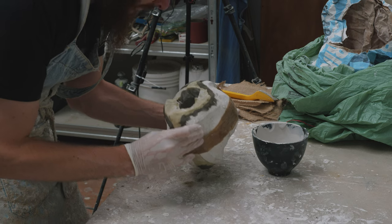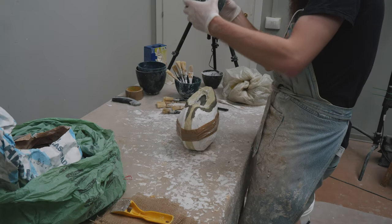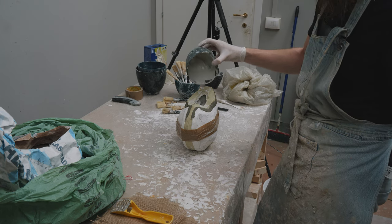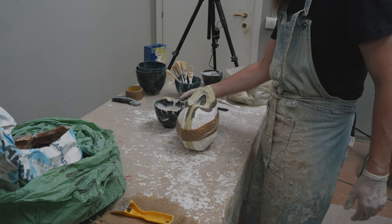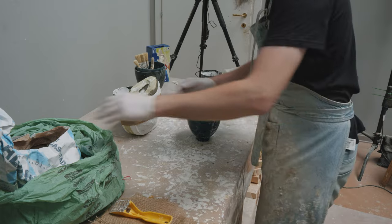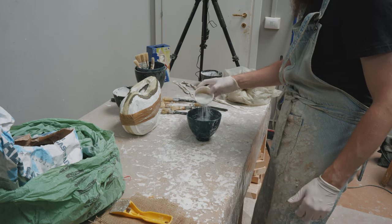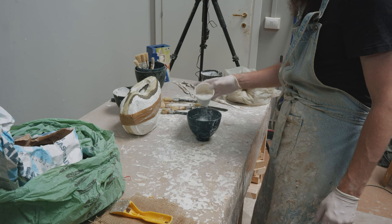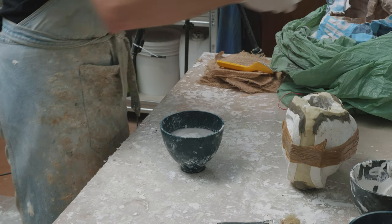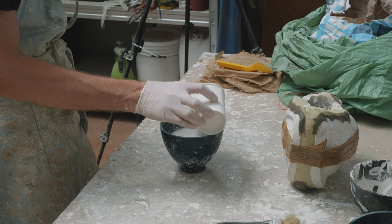Then it's going to become hard and cold, then warm before starting to cool down. It can take a while after it cools off before it becomes properly dry and as hard as it's ever going to become. It's important to know the timing of these stages because they impact when certain things need to happen when working with plaster. For example, once the plaster starts heating up — which can be around 15 to 20 minutes after you first mix it, depending on the type of plaster — it will start dissipating the moisture inside of it. When this happens, the old plaster won't stick well to new plaster added on top. This means all subsequent work where you'd like the plaster to stick to itself should be done before the plaster starts heating up.